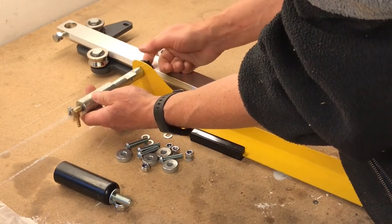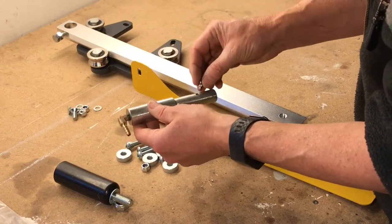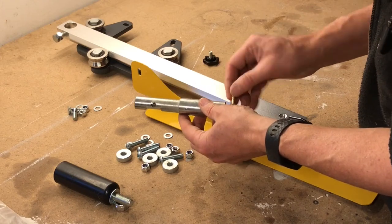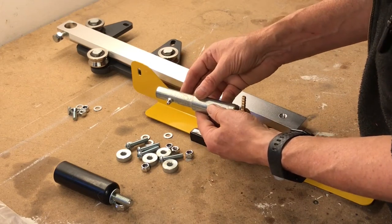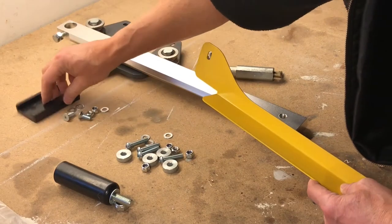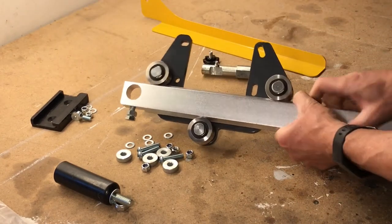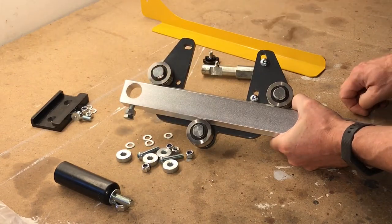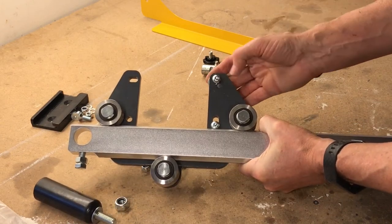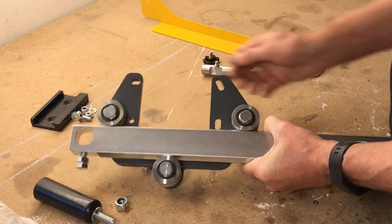And then you also see here the new shaft you get, the new shaft where you have the blade guide, where it will be mounted, and you also have a new watering system. Still have the hose in the back, and then the water will flow out to the blade in the front. And then you have the bolts and nuts for the guide itself. You have the four holes where it's mounted, and you have a kind of washer that has to be between this guide and the shield of the sawmill to keep the right distance.